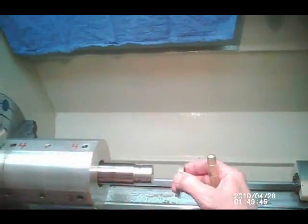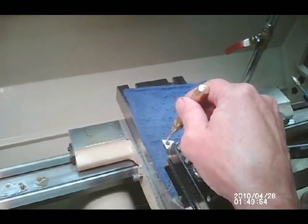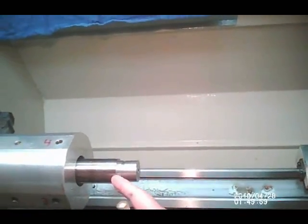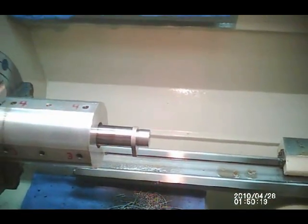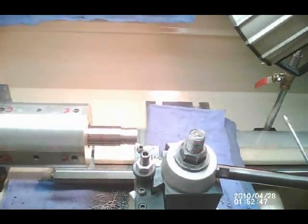Because I'm using a rather wide radius cutting tool — this is 11 and a half degrees — it gives you a very nice finish but does not leave a perfectly right angle corner. You must take your cutter and go down along the shoulder and put the radius down below this locking ring. This way your locking ring will fit snugly up against the shoulder without hitting that radius.